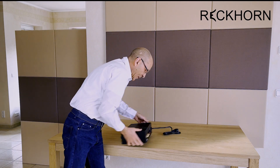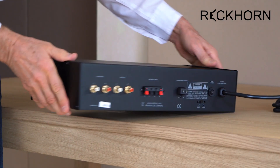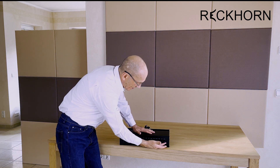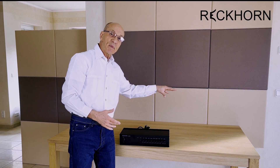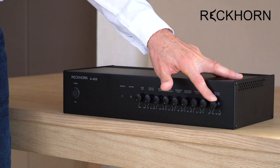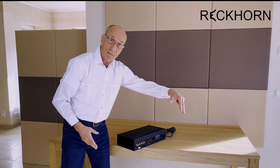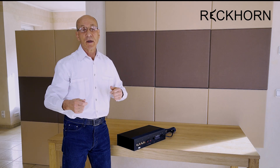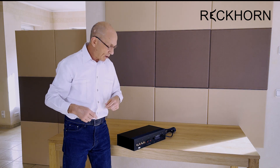On the back side you see an output. This is the input, this is the output. This output can go to another amplifier for the higher frequencies, and with this satellite low cut you can cut the low frequencies from the satellite speaker — just the opposite of the high cut. This cuts the high, this cuts the low, and then the signal goes to the satellite speaker's amplifier. The satellite gets relaxed from heavy low frequencies and will sound better, capable of producing higher sound pressure.